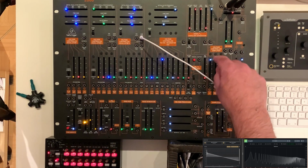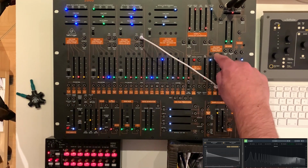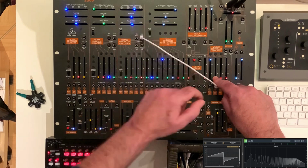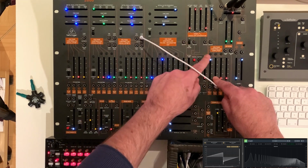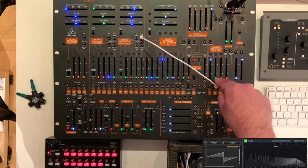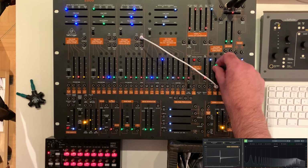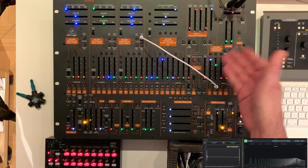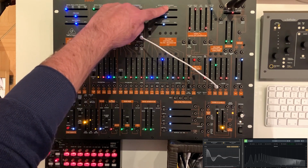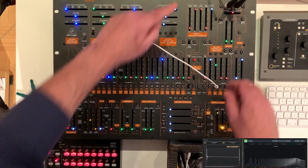And that's because now the direct signal of the sawtooth going to the ring mod input is much louder than this fader. So if you listen solo, this has this level. That's the output of the VCF low pass filter. And that's much louder. So what we have to do now is to find the point where it cancels against each other. Here. Yeah. Perfect. And now you have a resonant high pass. Okay, pretty easy.